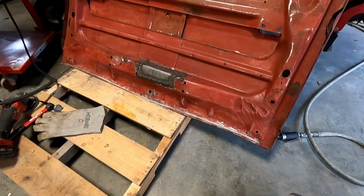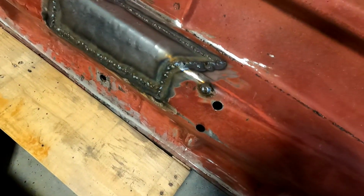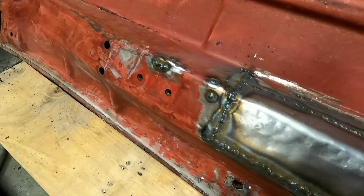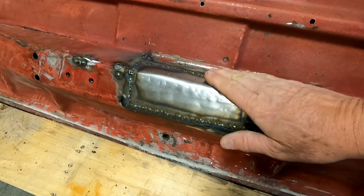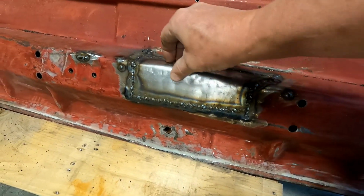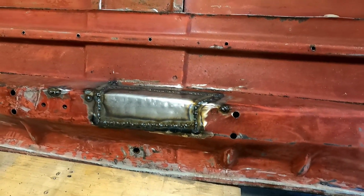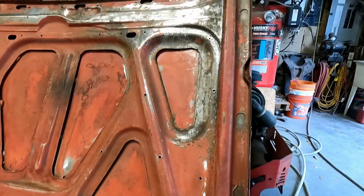All right. It is all welded. Even found a couple spots here that had a little bitty holes that he went ahead and tacked on. We'll grind all this off all the way around, just a little warm. And then where this has been beat to match all this, we'll put a little skim coat over the top of that after we grind it. And then that should be all that needs to be done to this underside of the hood.